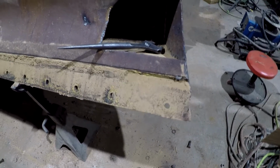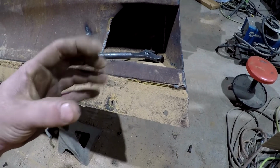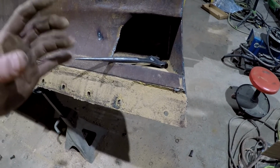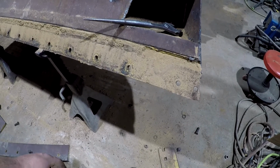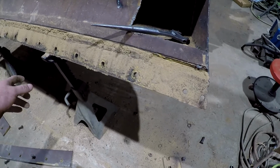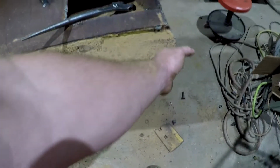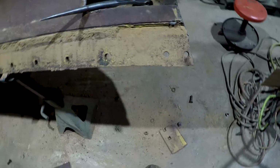And the 5/8 size, of course, the deeper the cut and the bigger the hole, the more they cost. They've got some that are like $300 if you want one of those 6-inch deep for the big drills, you know, by a 2.5-inch hole or whatever. Those are really expensive. But anyway, we're going to get this cleaned up here, and I'm going to have to pick this blade up. We're going to stick our other cutting edge here in the center, and that's going to tell us how far over our corner bit has to be, and then we're going to mark our holes out and drill our holes here.